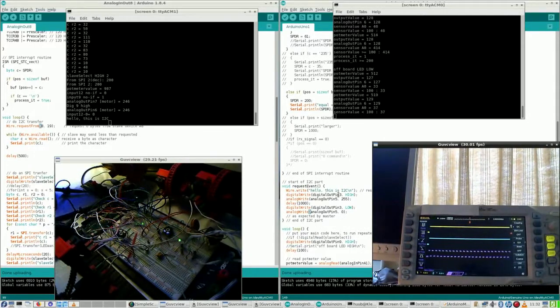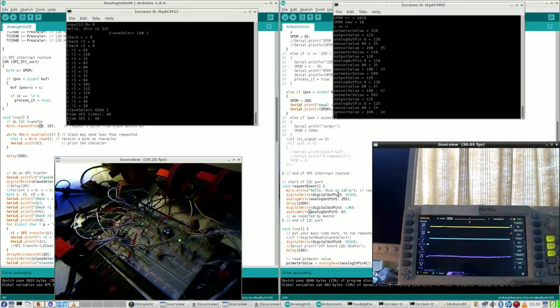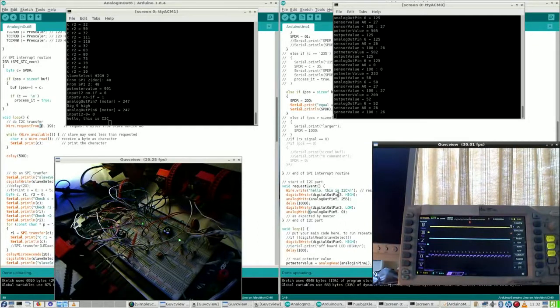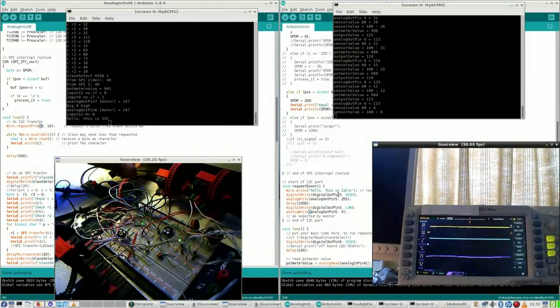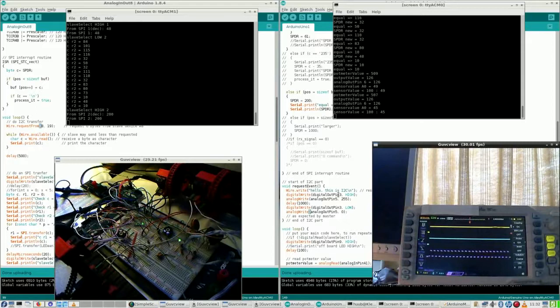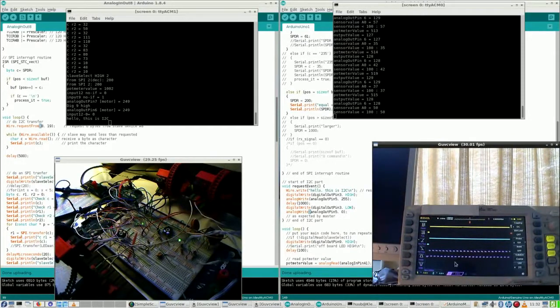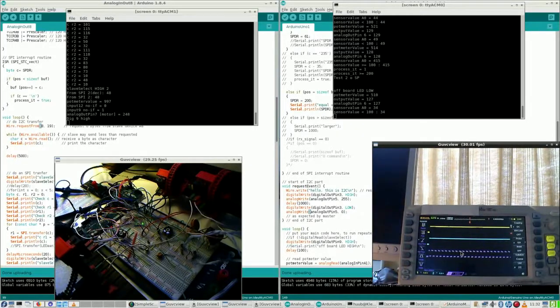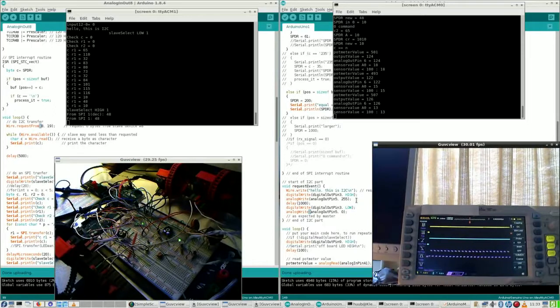What does pin 3 do? Pin 3 does nothing at all. Back to pin 5. With a little help. So pin 3 does nothing. Pin 5 does do something. I get a very nice fine signal. The only problem is, why doesn't the LED work? So I need to replace the LED. I can't put the value of pin 5 higher, for the simple reason that it is 8 bits and this is the maximum value.